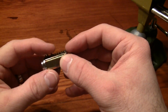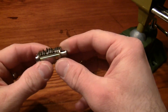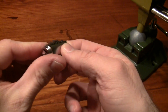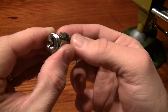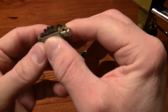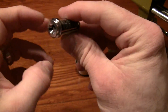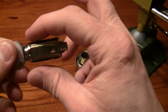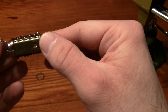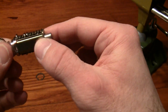As you can see on this side there are three wafers. On this side there are six of them. Chamber 8 is empty, which might be used for master keying. Hopefully you can see not all the wafers have the same profile — that's the reason why some wafers need more than one push to fully set them. With the key inserted, everything is in line. When an incorrect key is inserted, the wafers protrude out of the core and the lock would not open.